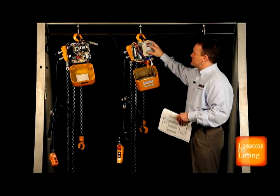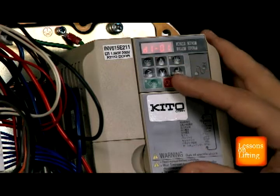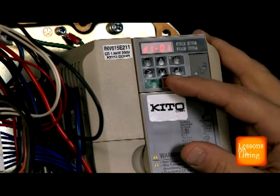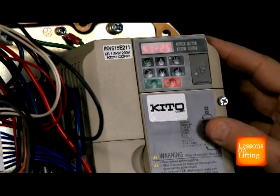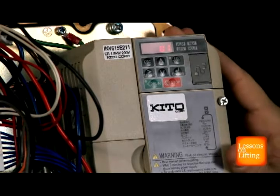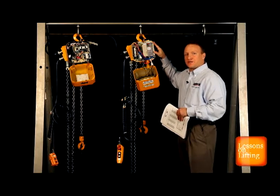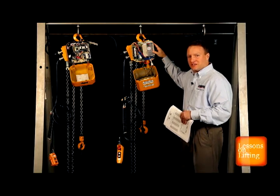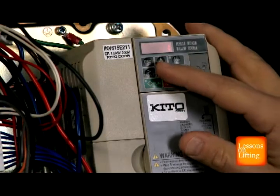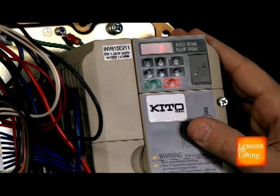The other unique feature about this hoist is the ability to go from 2-speed to 2-step. Again, using my parameters of D1O1, I simply hit my up button until I get to S125. When I hit enter, this will be displayed as 0.1, which means the hoist is currently set at 2-speed. To set the hoist at 2-step — which is the ability to set your ramp-up time from low speed to high speed and control and maintain your speed anywhere in between — I simply move my cursor over and make that a 0.2. Now this hoist will operate 2-step.